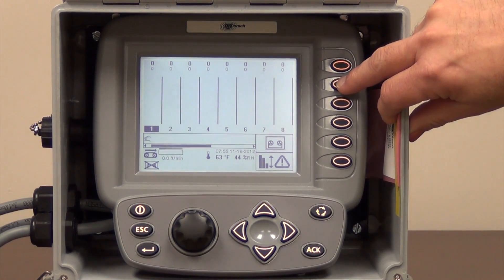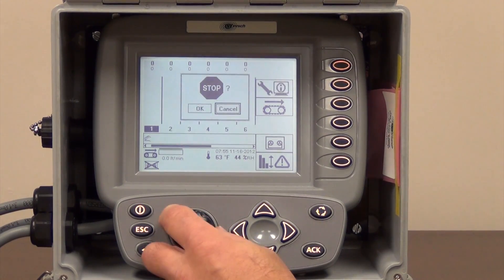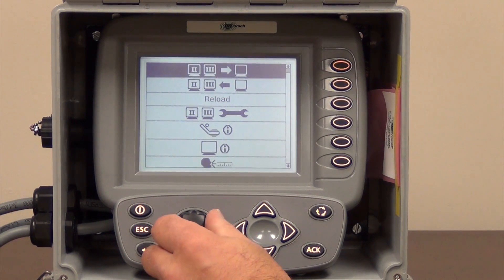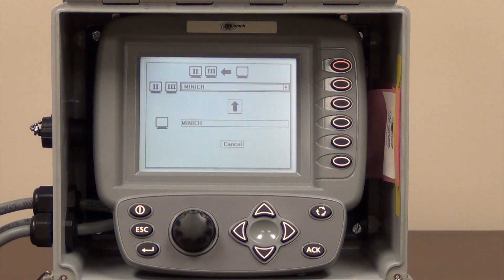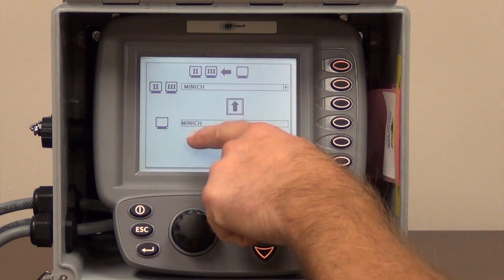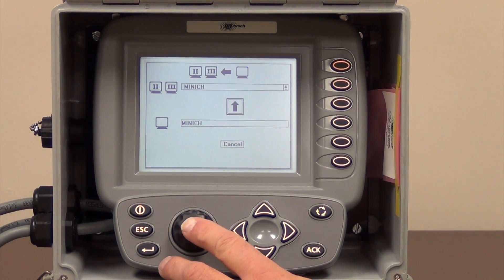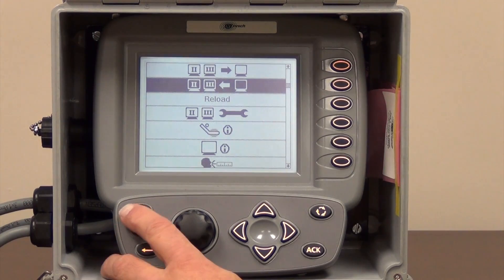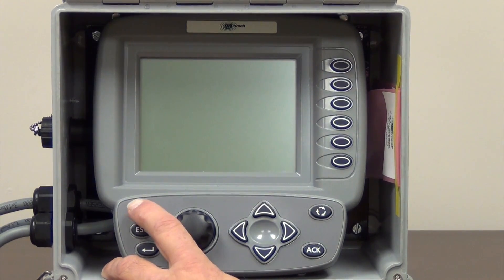You don't have to re-learn into the controller boxes or anything, but we need to save this back to memory so it is there the next morning. So we are going to open this back up again, come down to Roman numeral 2 and 3, open that up, highlight your OK box, open that. We need to save it from the monitor to memory — the second one down. Open that up and both of our boxes should stay the same because we are overwriting the configuration and saving it back to memory. The only way to get out of this page is you have to do a power cycle — that's making sure you accept and save all changes that you made.